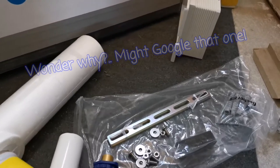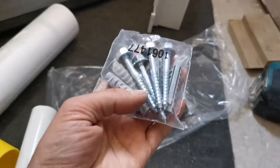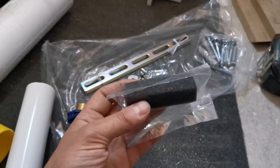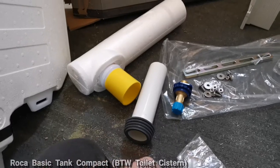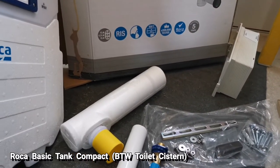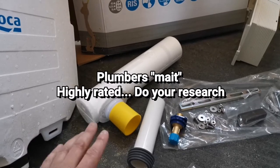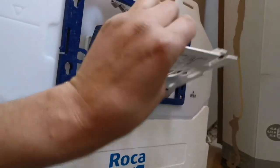There's no overflow outlet on these. In terms of other things you get in the box: four quite heavy-duty metal brackets, all your wall fixings — really heavy-duty, a bit like what you get with radiators, a bit overkill but better safe than sorry. There's also a little sponge with silicone inside it, so when you come to fit you can smear the silicone over all the rubber components and it should just slide together with no leaks. With a new installation like this I'll also lubricate with either silicone or plumber's mate, because I do not want to have to come back to this.